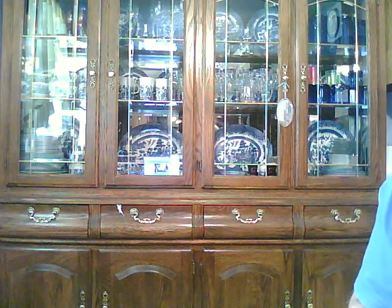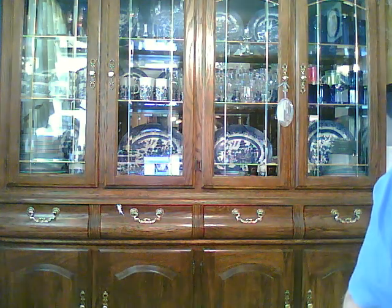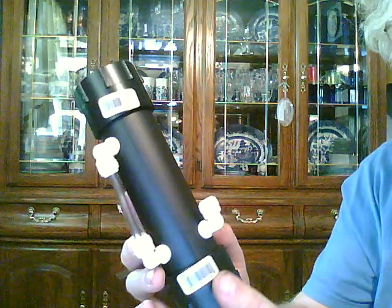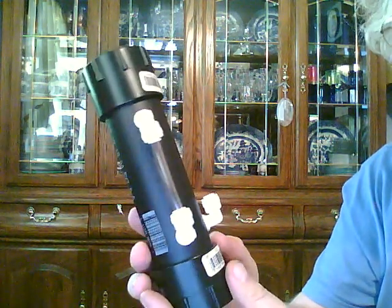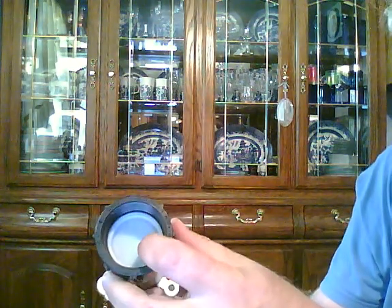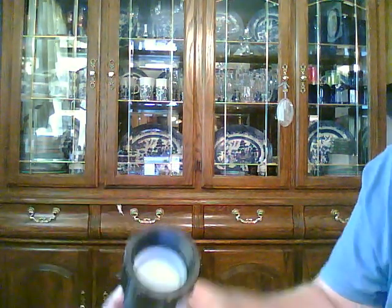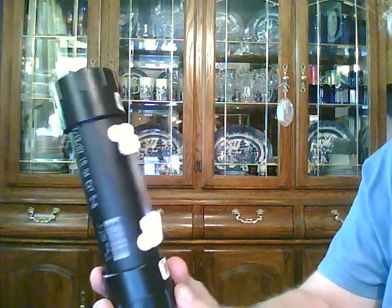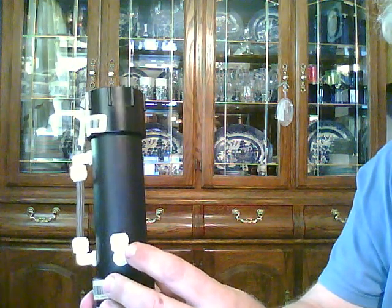I've got most of this already put together. I'm going to try to keep the file space down that the webcam takes up. The very first part of this is a very small secondary bubbler that I've constructed. It uses standard ABS. There are caps at the top and bottom. The cap at the top will actually have holes drilled in it — this is for a standard fill check, level check, water check, and of course a fill tube.